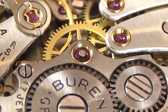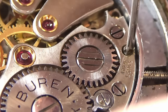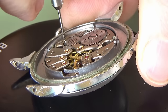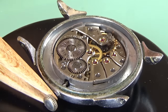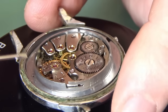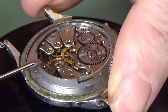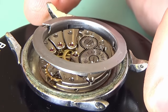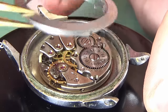We're going to get into this during the teardown and reassembly, which we'll be doing because unfortunately this is a non-runner — and I can see why already. We have a completely broken set lever screw; I managed to get it out a little bit and I'll have to tweak that out as we go. Now, if this movement ring was installed by Buren I'll eat my socks — there is no chance this is an original Buren part. It's the wrong size, which is why it springs out and nearly gives me a heart attack.